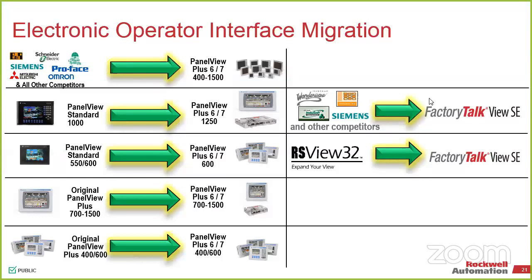That's the route we're going on there because it's a single connection, but it's a completely new style of product. But for anything that's legacy migrations, modernization efforts that we're looking at, the 7s will still be our go-to. Now, some of you guys know, but the 7s are only Ethernet based. So if we still have some type of serial DH+, those type of systems, those are when we start getting into like, how do we engineer that side of it?